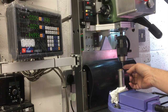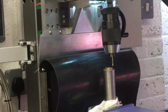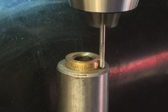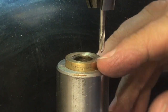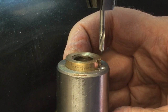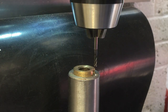Right, let's see if we can set it up on the drill and drill that out. We've just about got enough travel to get a small drill in there. That's a centre drill so we'll put a little hole in there, get that started and see if we can get a 3mm twist drill in there. I'm not sure — I might try an end mill instead. Okay, I've got a 3mm end mill in there, let's see how we get on.